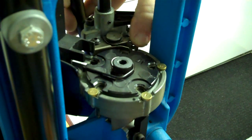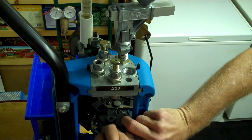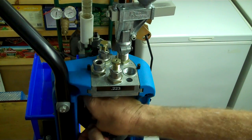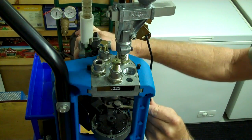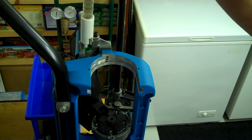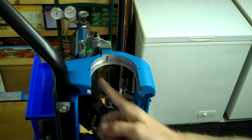Now that I know the primer system is completely empty, I can go ahead and load in the Magnum primers. With the machine totally empty, I want to take off everything that is not bolted down — everything that can be done with your fingers. I just took out the locator buttons, now I'm going to take out the extractor for the cases, take off the fail-safe rod, pull these two pins, take off the entire tool head, and pull off the tube for the case feeder. I'm going to go ahead and clean that while I'm at it. I'm taking this adapter and this little green part, and I'm going to change those.